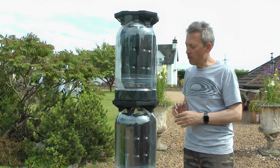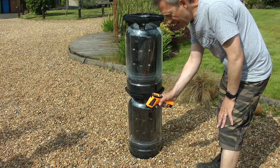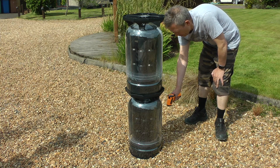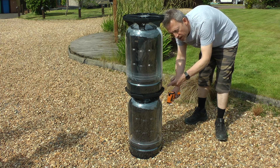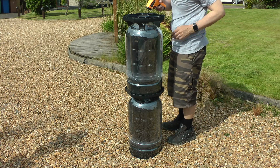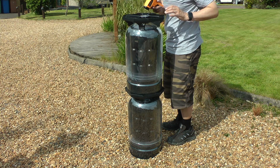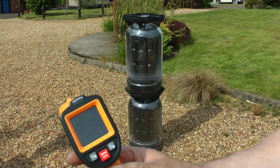This key keg stack — one fits neatly on the other, and the hole in the bottom of one lines up with the top hole of the other, effectively doubling the solar air capacity of the tower and making it even more efficient. I've got a digital thermometer here: pointing at the ground it reads 28°C, around the back in the shadow it's 18.5°C — that's where the air is being taken in at the bottom. It's been out here a few minutes now — let's see what we get at the top: it's reading 40.1°C. You can feel moist hot air coming out. Let's try again — 42.2°C. Very subtle, but it's definitely working.